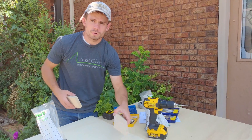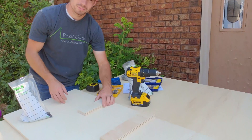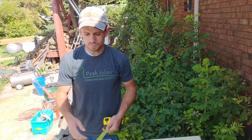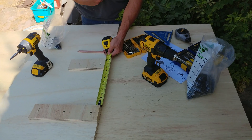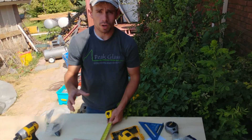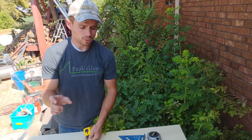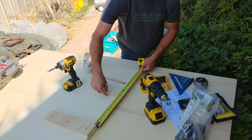Now that all pieces are cut, I'm going to pre-drill the holes to attach to the workspace and countersink the hole a little bit before drilling the pilot hole. Your workspace goes right in here, but you have to allow for 2⅜ inches wider than the piece you're working on. I'm working with 11¼-inch wide stock, so adding the 2⅜ inches — for the two wedges that will wedge the material — puts me at 13⅝ inches total distance from the fence to the backing block.